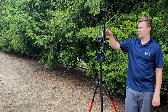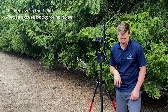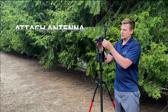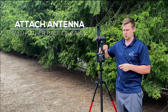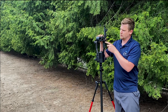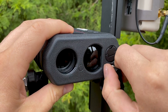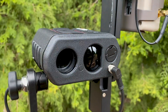Now we need the True Angle and the TruPulse to talk to each other, and that is via a cable provided with the kit — a little four-pin cable. One end goes to the front of the 200X, the other goes into the laser port of the True Angle. There's only one way these ports can go in, so put it in and rotate it until you feel it lock, then start threading it in. If it's really hard to thread in, don't force it — pull it out and try to reseat it again.